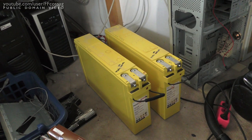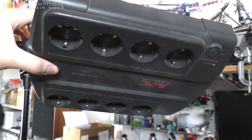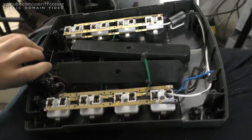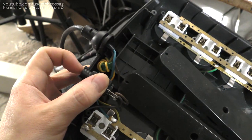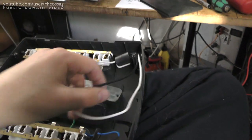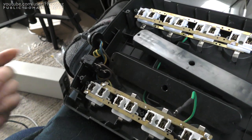I'm going to wager these are going to be about half of their original capacity — somewhere around 30 to 40 amp hours. While doing this, I've apparently run into some extension leads, but that's fine because I've got a bunch of these APC UPS shells, which are lovely to just turn into big, chunky extension leads that even have an integrated 10-amp breaker. It's super easy to do this conversion — you just remove all the electronics, and then you're left with black and white wires going from the previously UPS'd output. You just solder these onto the non-UPS'd output, which is already connected straight to the mains, and then you're good to go.